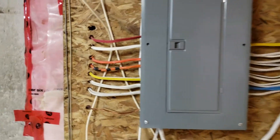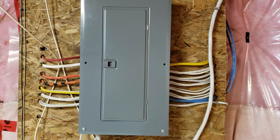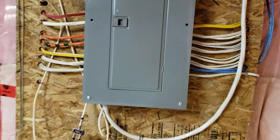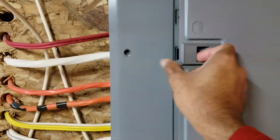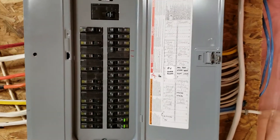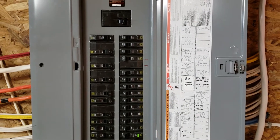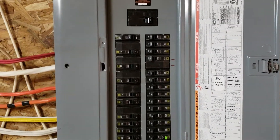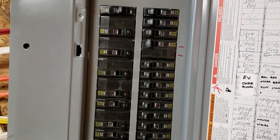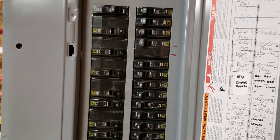Hi, I just wanted to give you an overview of my line that I've put in to do my EV charging at home. I put in a 60 amp service on my breaker. My breaker panel itself is serviced by a 100 amp service. Even though I have an AC and a dryer which comes close to 50 to 60 amps, all I have left after that is just 40 amps.